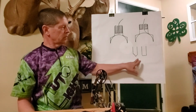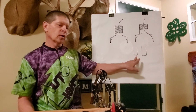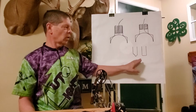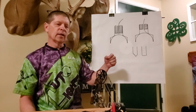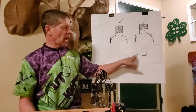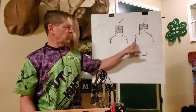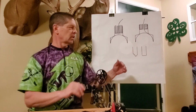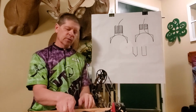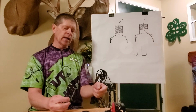This first one shows when you clip off your fiber optic with a fingernail clipper or a scissor or whatever, it's going to pinch it off. You can visualize using a side cutter on a piece of wire, making two angles on the end of the fiber. When you put the light through the fiber, those two angles are going to want to send the light out in different directions. So that doesn't really help us. Makes your pin want to starburst and causes those kind of issues.